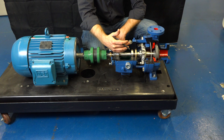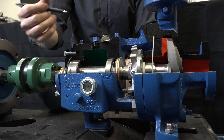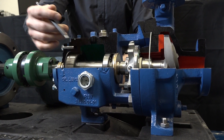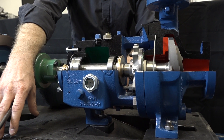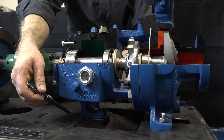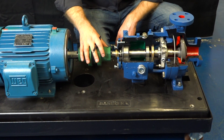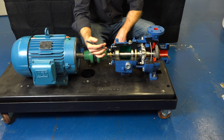The root cause of vibration can be a lot of mechanical issues, such as unbalance of mechanical components like an unbalanced impeller or shaft. It can also be due to a non-rigid foundation or base plate. Sometimes you have loose bolts on your feet or soft foot conditions, along with coupling misalignment where your shafts are not aligned between the pump and the motor.